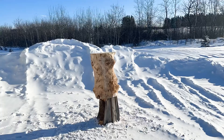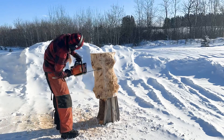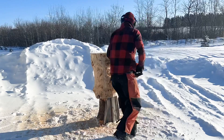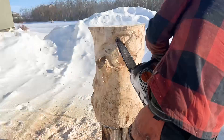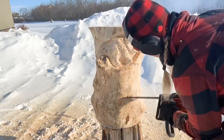Here I go with the carving bar. The first cuts are shallow outlines — basically just redrawing the outlines with the tip of the chainsaw. When doing this, I make sure to use the bottom portion of the bar tip whenever possible and avoid cutting with the upper half of the tip to avoid kickback. Once I have a section outlined, I come in from an angle to cut off wedges from around it to create depth. I have to be careful not to overcut on the angles and only cut as deep as where I outlined. I'm shaving away the background and the negative space within the tree holes to help the raccoons pop out and appear more 3D.